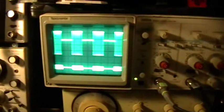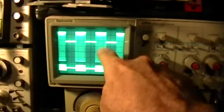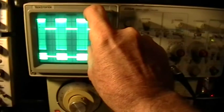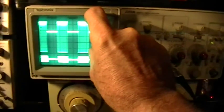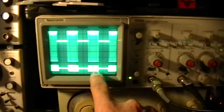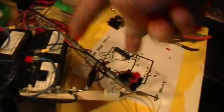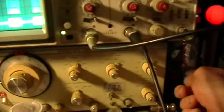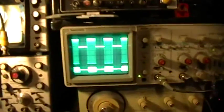Okay, so let's go back to the oscilloscope and turn up the function generator amplitude. Okay, and once again, you can see that the inductive resistor is indicating 1, 2, 3, 4, 5, 6, that would be almost 12 volts of drop across a 1-ohm resistor. Okay, and then here we have the non-inductive resistor, and these are both indicating the same current because they're in series. Okay, the same real currents are flowing through both of these resistors and the function generator. 72 volts, people, 72 volts. Oh. I swear this is like shooting fish in a barrel.